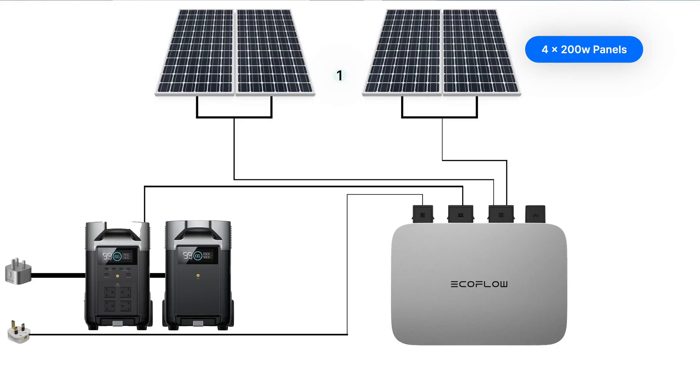These two strings of panels are connected to an EcoFlow PowerStream microinverter. This little metal box is amazing — it reminds me of the design of a Mac Mini. It's really well designed, really well built, and it can output up to 800 watts. It can also accept two separate strings, so in my case I've got two panels per string, wired in parallel to keep the voltage down to 70 volts per string, connected to the PowerStream.